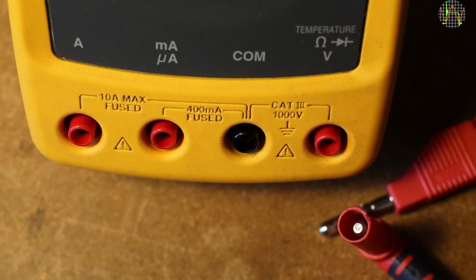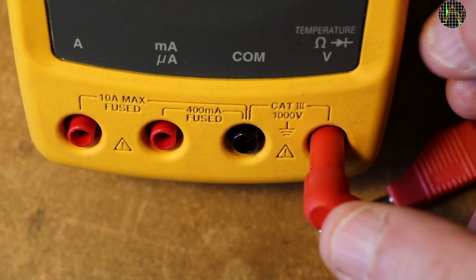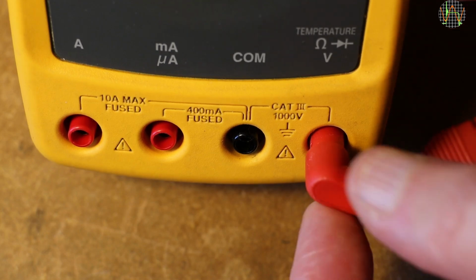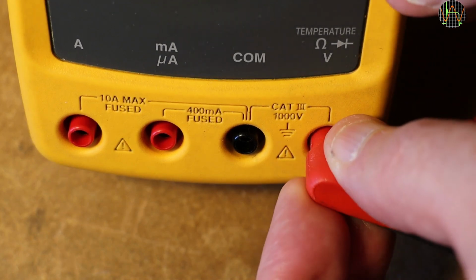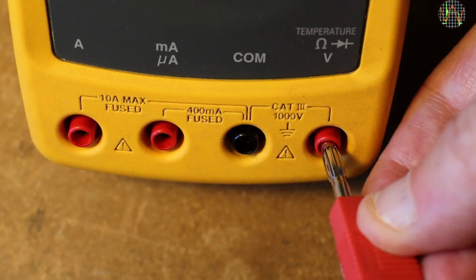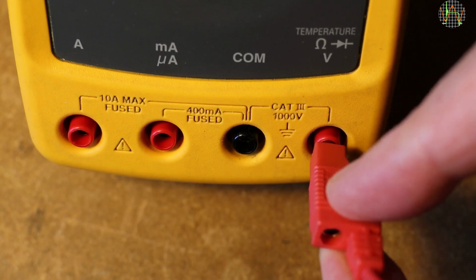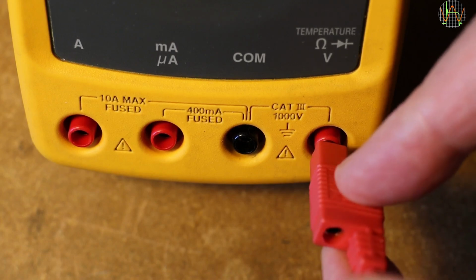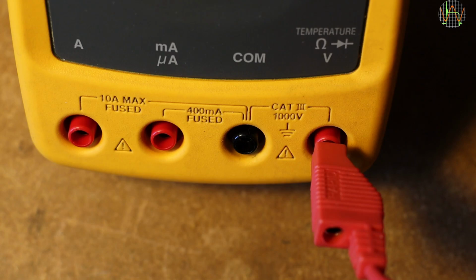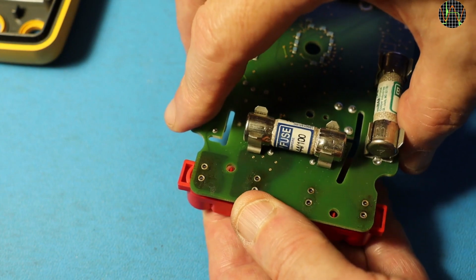That sideways knock simply sheared the connecting pins off the PCB. It probably would not have happened with a shrouded plug because the shroud surrounding and supporting the socket would have transferred much of the force to the case. But for a standard 4mm banana plug, the socket is basically a freestanding pipe that is only fixed with the 2 pins at the bottom with no other support. I never thought of this before, but it seems many multimeter socket constructions are quite vulnerable to that sort of accident. Good to know.